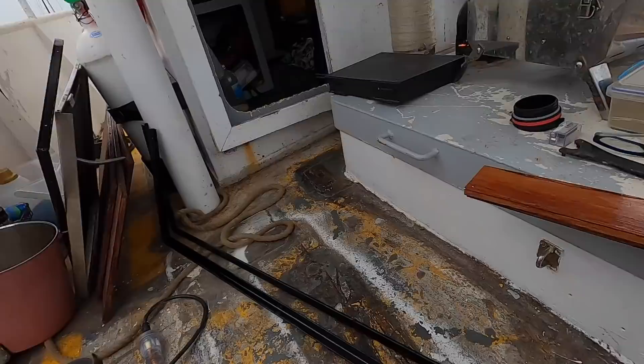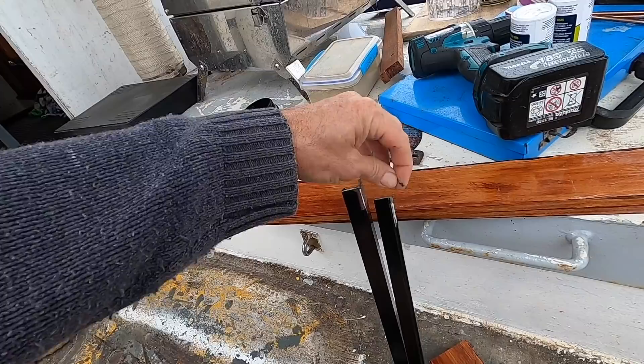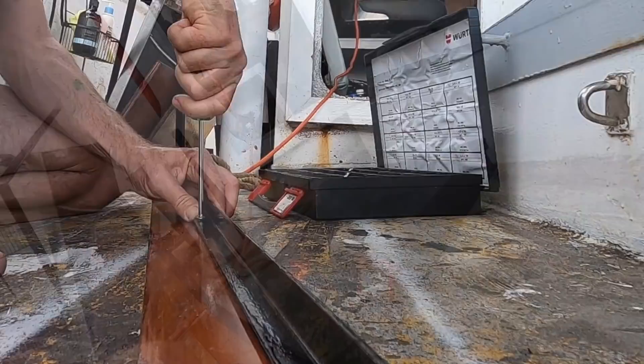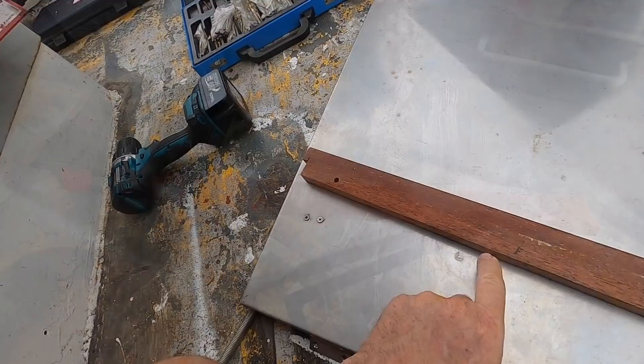Still in the marina and it's raining but we'll push on. These are shelves going down in the cabin for clothes and things. I've got them all painted except where I'm welding. I'm going to screw this timber onto the front — timber all around as a lip on the shelf — but just putting the fronts on now because we'll be welding near the side timber. The plan is to use really short screws going through the steel so there are no visible screws on the outside.